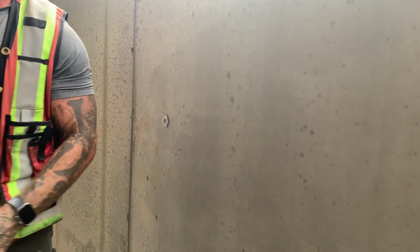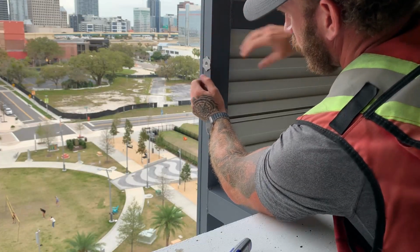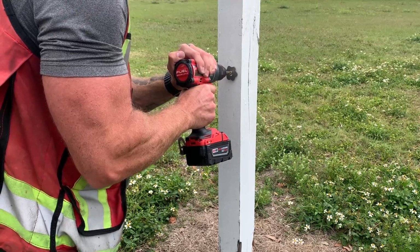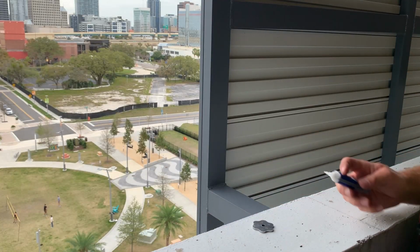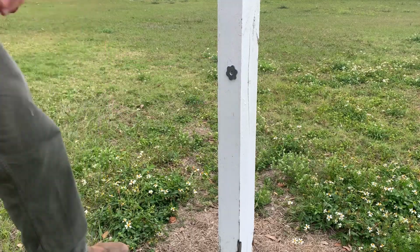They can be held onto walls, floors, ceilings, or literally any flat surface you can think of by either using wood screws, concrete screws, double-sided tape, or adhesives depending on what you're trying to mount it on. The standard stainless discs are relatively very inexpensive, with the idea they could be mounted permanently and left on site for repeated use throughout the life of the project. The prism comes off and is kept safe with you where it can be used elsewhere on other jobs, but the mounting disc stays securely in place for repeated use.